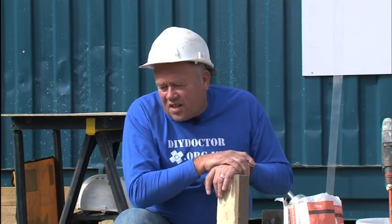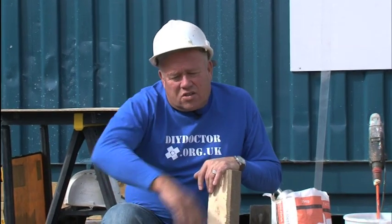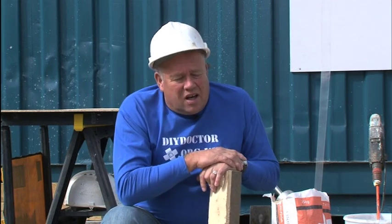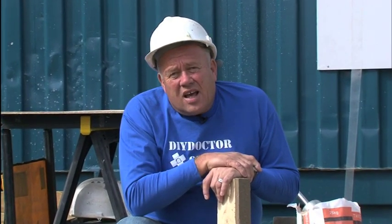Okay, so we've got a section of foundation trench, uniform thickness other than the rocks that you saw in the bottom. That's going to go hard. We'll leave that for 2 or 3 days and we will strike the shuttering, and then we will load this foundation trench with blocks and bricks just as you would if you're building a house on it, and we'll wait until it cracks, and you'll see the results of that on the website and probably in our next book as well.